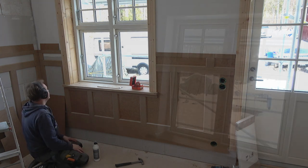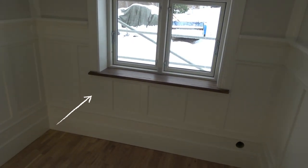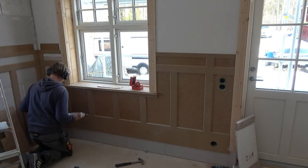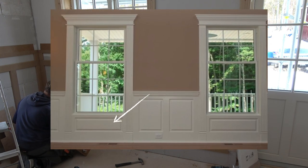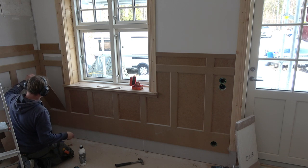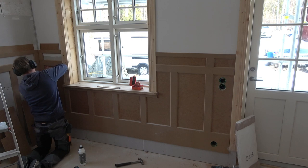My rooms are small, so I let the panel decide the pattern, and all the openings and obstructions have to adapt. This means I get an even flow on all the panel compartments, and makes my OCD guests happy. If the rooms were bigger and my windows were not so close to the wall next to it, I would let the windows decide and everything else adapt. I can't do this in my house, as the wall next to it is too close, and all the compartments would have different widths, which is not nice to the eye. So I chose to let the panel decide.